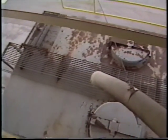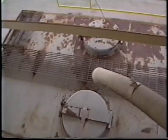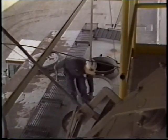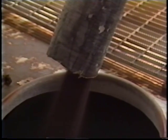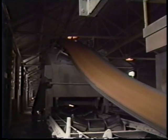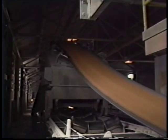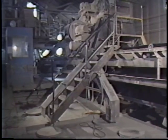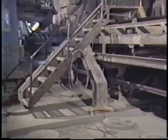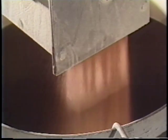When sampling an incoming shipment of roofing granules, it is imperative that you obtain a truly representative sample. This will allow a correlation with the grade 3M obtained upon shipment using the same sampling techniques. Grab or scoop sampling is simply not good enough, because granule particles will segregate under any sort of free movement. A representative sample will make sure you get a true picture of the entire load.